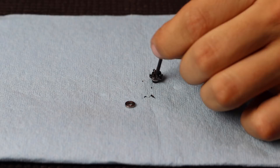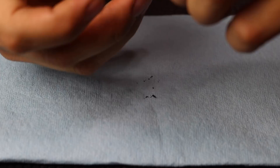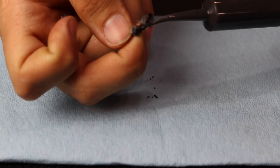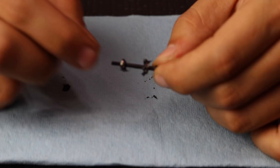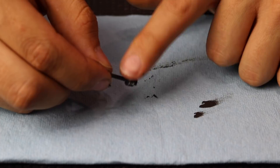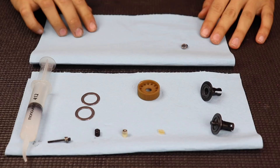Definitely don't be afraid to put grease on. Then the next step, I'll put the last washer on and flip it upside down, then put more grease on that cage — just so you get grease everywhere. Then I'll put it slowly together. You don't want to go fast; you want to go nice and slow. The excess grease you can take off with your hand. Once you get that part built, you can just put that to the side.